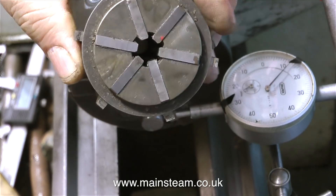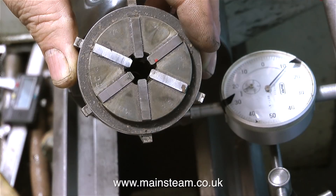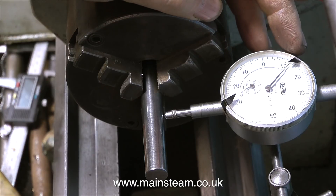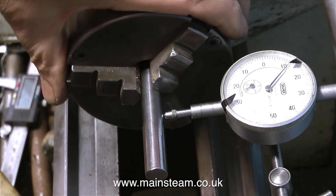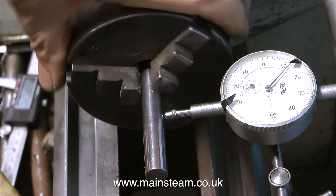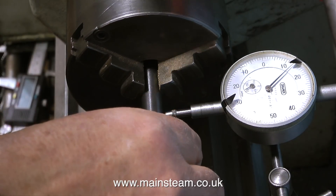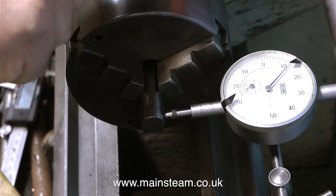It's far better engineering practice to use one of these — this is called a collet, and it fits in a special collet chuck. I have one of these with many different sizes that fits in the larger of my two lathes. As I frequently mention, these tutorials are designed for the beginner to the hobby of model engineering, and most beginners do not have a collet chuck just laying about in the workshop. In any case, because this is a half-inch diameter piece of bar designed to be turned down to 7/16ths of an inch diameter, with the end part turned down to 3/8ths of an inch to suit the crank web, you could really use any old chuck for this, because if you're just turning the part from scratch and the entire part is turned, it's going to be accurate. But if I want to use this piece of metal as the finished diameter, it needs to run very accurately so that the 3/8ths of an inch part that I turn on the end is concentric with the diameter of the rest of the piece. And that's why I'm using a DTI, dial test indicator.